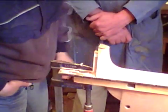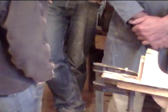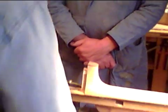So get most of your carving done with the rasp, but you can do final touch-up with this block and with some of the other round blocks, like this, for instance, or this. Just look around your own workstation and around the shop. You can use this in here, or this, if it's the right contour. But straight sandpaper you can't carve with. So you do most of it with the rasp, that's faster, and then you can do final tweaking with the sandpaper. So I'm not going to do much more on the heel because you'll figure that out. But just be aware of these blocks, and that it could be a really good friend to help you carve the heel.